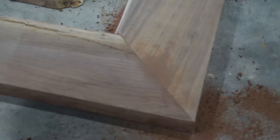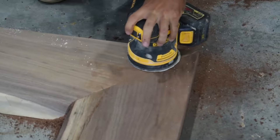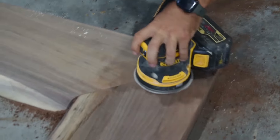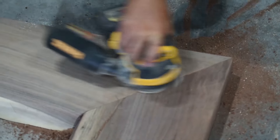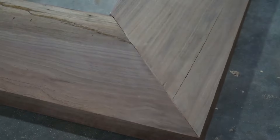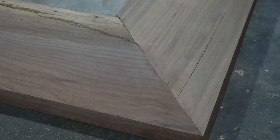Now I'm going to let this dry, let that glue set, then come back and sand this down. I've got some 220 grit sandpaper and I'm going to go over that area that I applied the putty. By doing that with that same sawdust and glue, you're able to make the exact same color that you need, so the putty isn't drying a different color than the wood you're using.